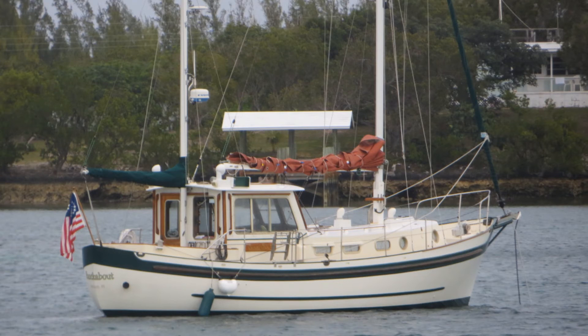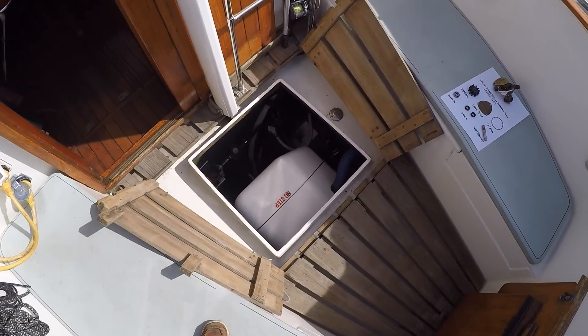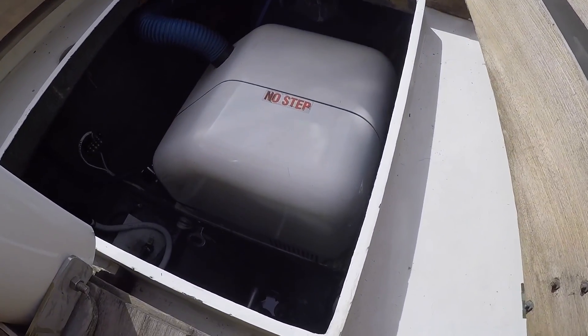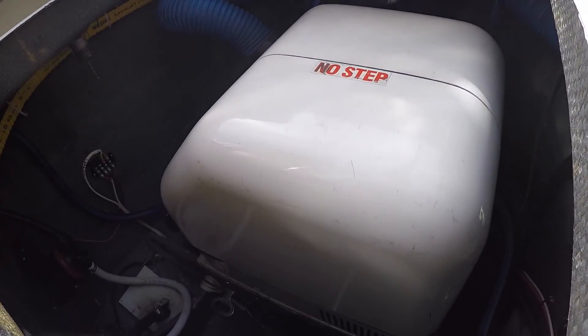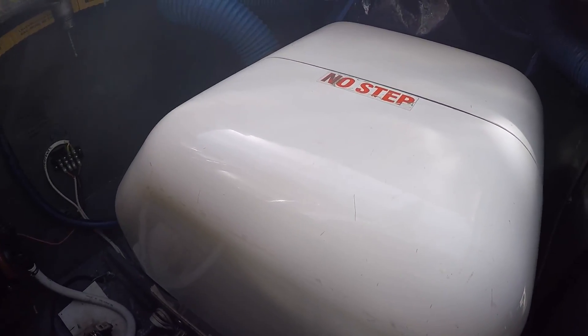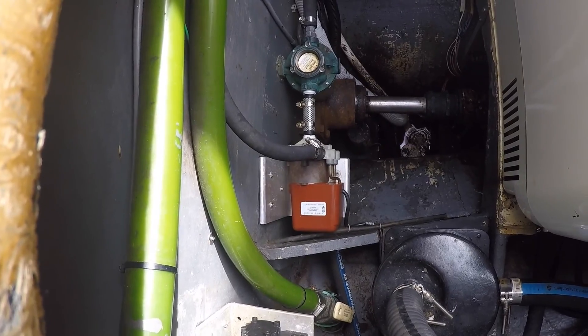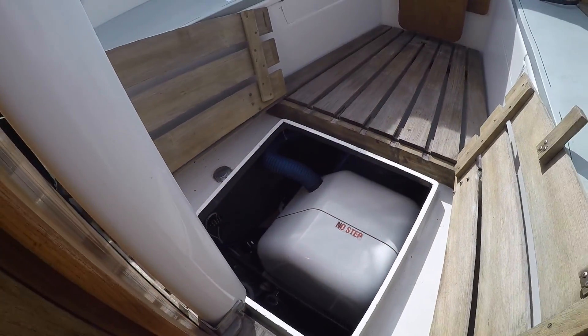Let me show you what we did aboard my boat — maybe you'll consider trying it on yours. Our generator lives below the cockpit sole; that's it in the white hush box. My solution was to remote-mount the raw water cooling pump in the form of a fully waterproof and highly reliable 110-volt magnetic drive pump. This pump must be installed below the waterline to work, but if the flow rate meets the manufacturer's requirements, you'll have minimized the probability of destructive saltwater leaks.